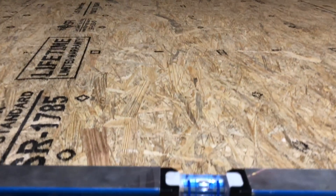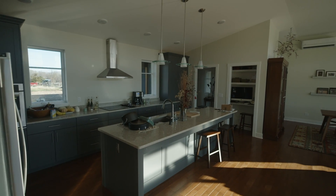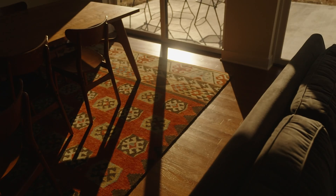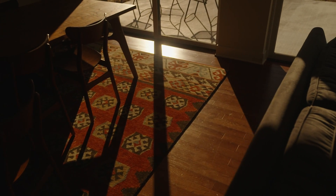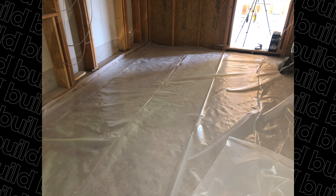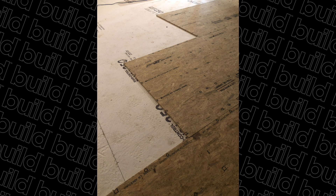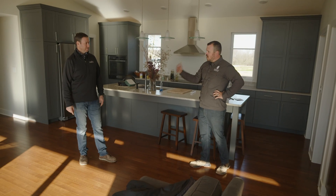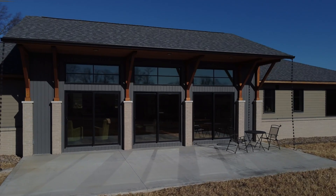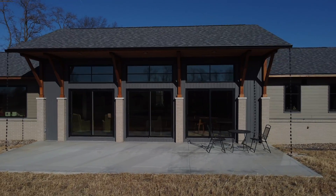As we walk on this floor, we're walking on a big boat — hardwood floors nailed traditionally to subfloor, the subfloor glued and screwed together, but no hard attachment to the foam below us. The foam is just four-by-eight sheets loosely laid on the compacted aggregate. The genius is that it's regular carpenters doing things they normally do. Our project manager on this job was our landscaping contractor for ten years before — scraping aggregate the same way they would for a paver patio.